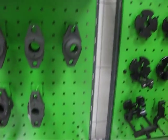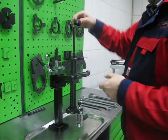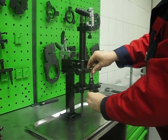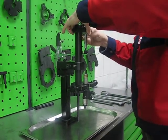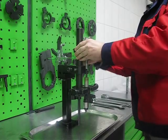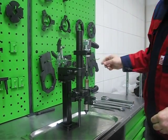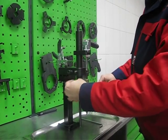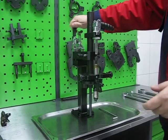For trucks there is a special adapter plate. We can attach this adapter plate to the vertical shaft of the clamping device. Install the injector to the groove. Adjust the correct position of the axial clamp and fix the injector with the axial clamp. Then we can adjust the correct position of the radial vise — touch the body with the flat jaw and fix the body with the three-angle jaw. The injector is fixed now.